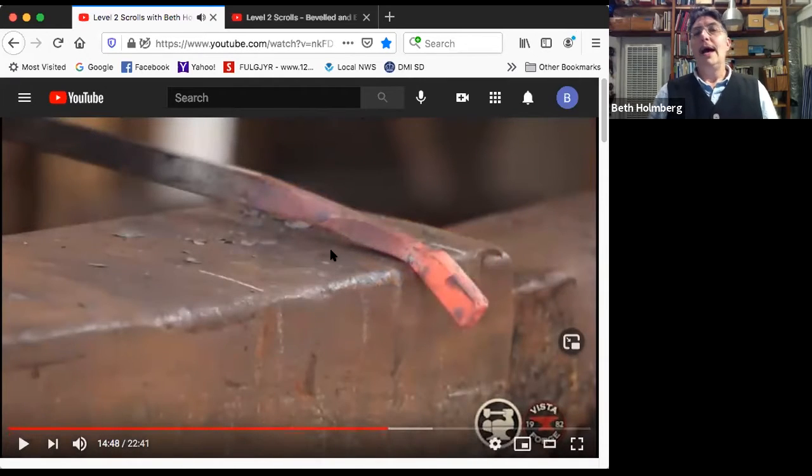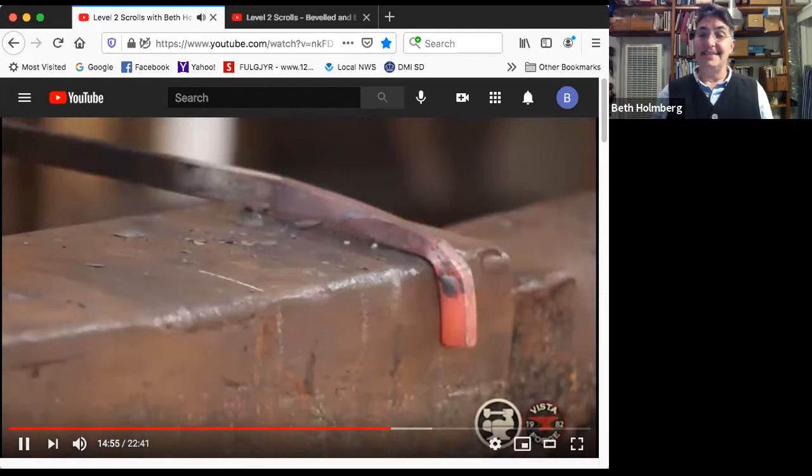So, excuse me. I'm going to do half face blows and then flip it up. Here's my half face blows above, and then that's going to get bent, not mashed, without doing any forging out in this section to set me up for my upset. So this is this weird little flip. And again, I'm doing it over a rounded corner, so I'm not putting any nicks in here.